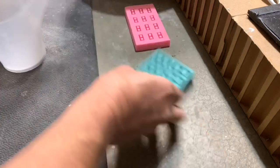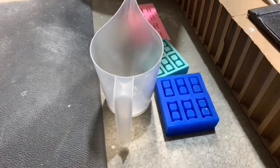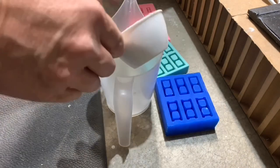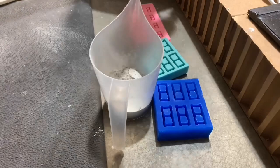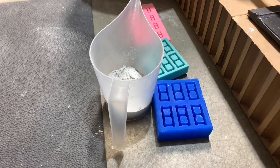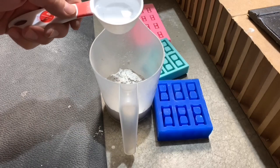We'll get those laid out, ready to pour. For mixing, I've measured out what I need for six bricks — just a half a cup of Rockite, just under half a cup. And for the water it's just under a quarter of a cup. We want to make this a thin slurry. If you get it too watery you get bubbles. If you get it too thick you can't pour it fast enough and it doesn't fill the molds well — you get air bubbles as well. So a good thin slurry is what you're after.